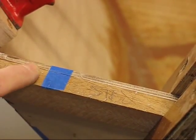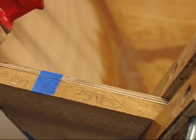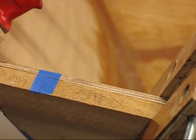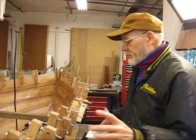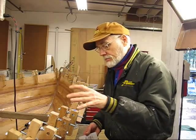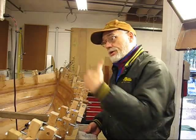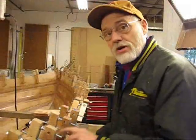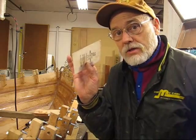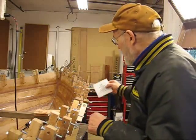I've put a bit of blue tape on the top of the rail and over the top, so I've got a guide. I've split it with the box knife so I've got a guide to get me along when I start clamping — I just have to put a clamp on here and I'm ready to go. I've got the outside rail on and screwed in, and then double clamped in between the screws. I used the serrated scraper that we used when scarfing to even out the epoxy so I've got a nice bleed-out.